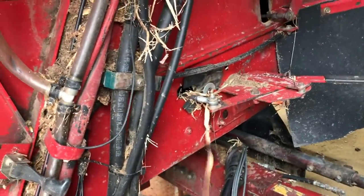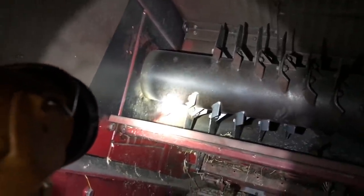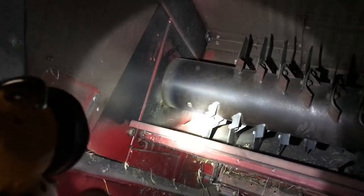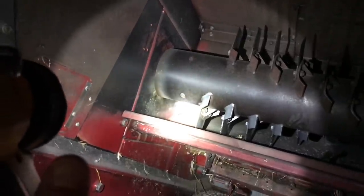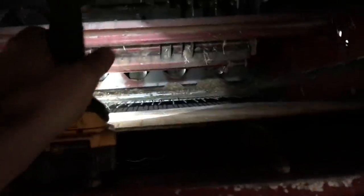You can see these grease lines are charred up — I think they're okay though. This area burned, but I don't think there's any major damage, it just charred stuff. I took the spinner off the back and realized the inside of the combine was on fire — right in that corner and that corner. Debris builds up in a void there. A bearing went out over there and started a fire inside, then going through the field it was throwing flame and smoke out the back, and the spinners were spreading it.